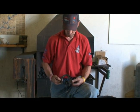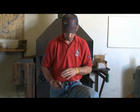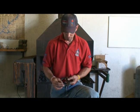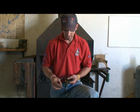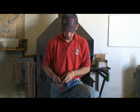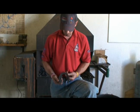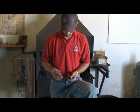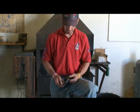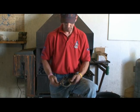It's pretty. It's just a complex shoe to make because once you clean up one side, you go back and forth so many times. Try and take as little material off the back end as you can because that will grow, and if you don't get enough, you can always tear a little more off. It's 120 wide. It's punched pretty good, and you want to have city head. You keep doctoring on that city head punch until you can get it just right. Mine don't fit just right, but it's still early in the year.